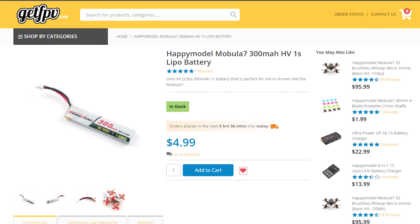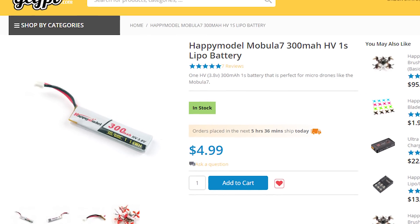So what I did is I purchased Happy Model 300 mAh Tiny Whoop cells — not really known to be the highest performance packs you can get. I also chose them because they come with wire leads, as opposed to packs where the pH 2.0 connector is soldered directly to the cell. Those wire leads let me do something I haven't seen any other tester do: test the exact same pack, cut the pH 2.0 connector off it, solder on a BT 2.0 connector, and rerun the test with the exact same cell. The only thing that's changed is the connector.